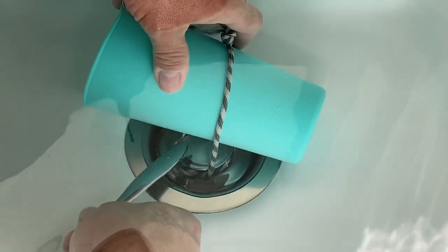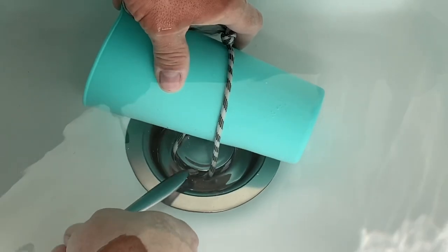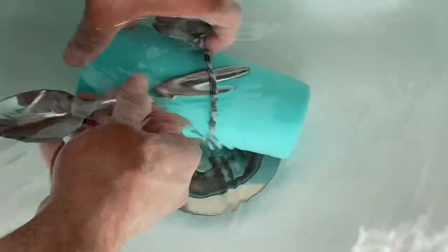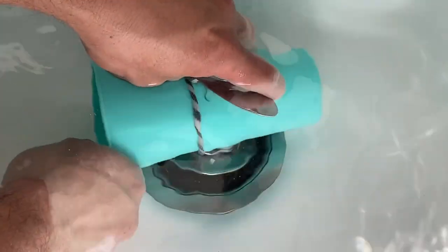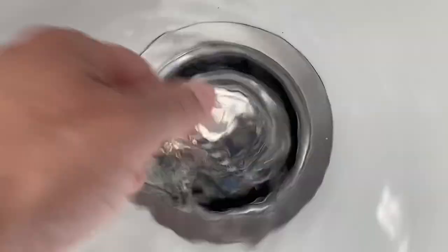The top of the stopper is lower than the bottom of the cup. As I tighten up these strands with every turn, this constrictor knot is going to tighten up and the whole system is going to winch the stopper up and out of the sink. You can already see it. And if you want, you can leave your cord in place because it's tight enough for next time.